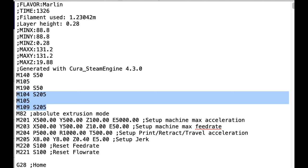This serial approach avoids pulling too much power from the power supply — first the bed, then the hot end. But many printers can handle heating both at the same time because they have enough power in their power supply. So the question is: can we change the Cura slicer to not generate this code and instead generate code that heats them both at the same time?